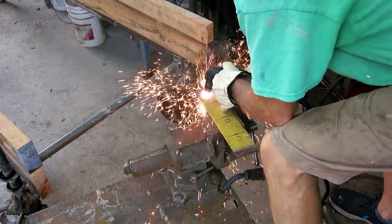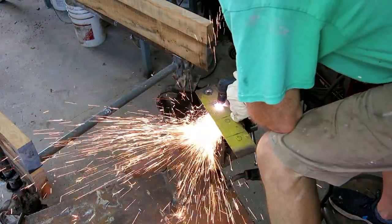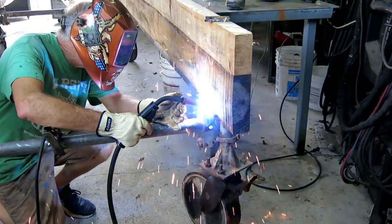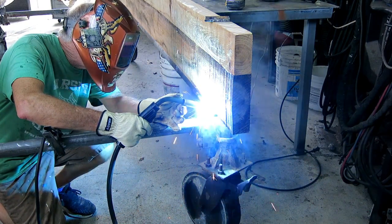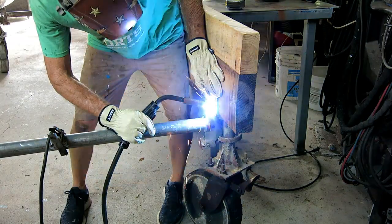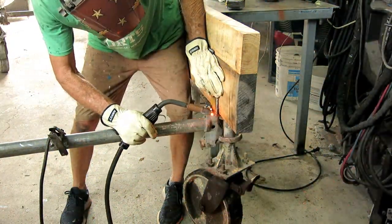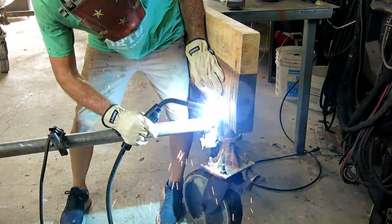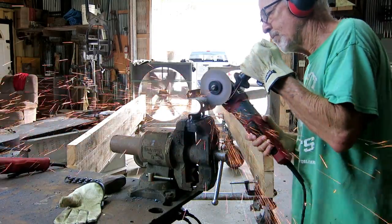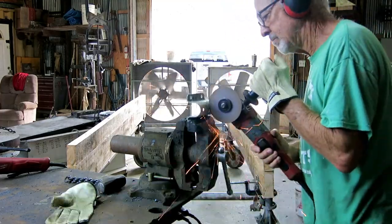I pulled some boards from my runners, glued them together, and brought them back. I welded small flat plates on the rolling scaffold to spread the load, then cut and welded little brackets to bolt the boards down and hold them steady. The scaffold brackets are great — I just needed to make sure my part is strong enough. I also found a clip to secure the timber back to the vertical leg so they can't flop over sideways.